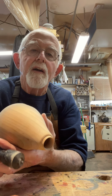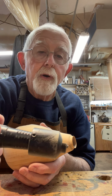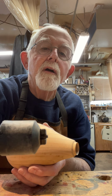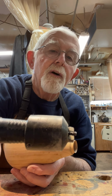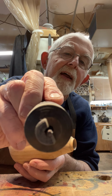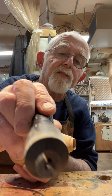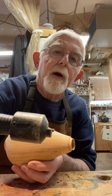And what I have done is I have made a sleeve that fits on my RAM carving tool, just your standard 40,000 RPM micro prototype, micro motor carver. But I made a sleeve out of UHMW. It slips on the nose of the carver, and you can see there half of that surface has just been cut away, so I can see the bit, the burr as it's turning, but it also acts as a stop, kind of like half a router table, as it were.